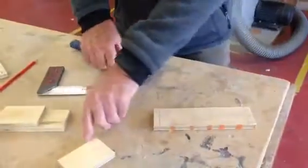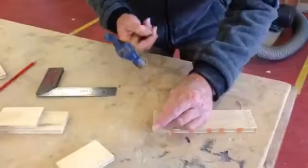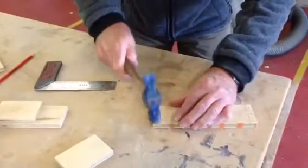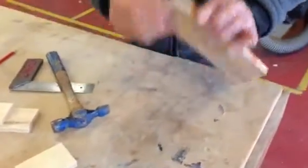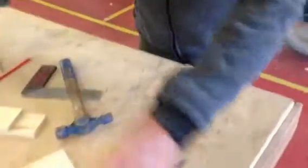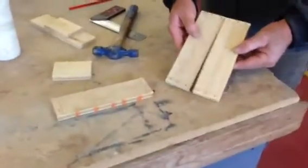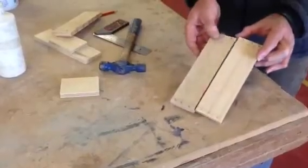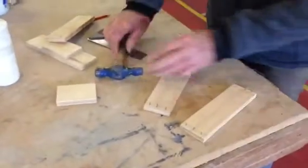So what we want to make sure is it's nice and simple for us to assemble. What we'll do is put nails in each one of those dots and nail it through just until you can see or feel the nail come through. We'll do that to both ends of our sides, so we end up with three nails in both pieces of our long end bits.